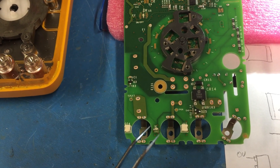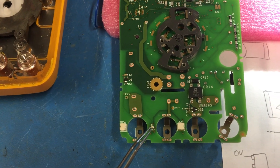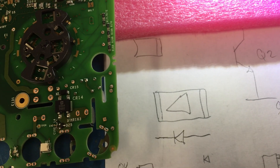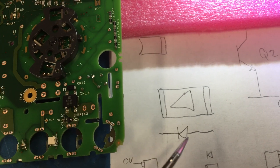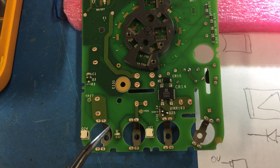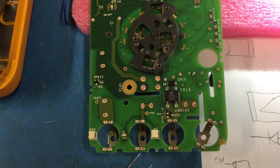There's some drive circuitry for the LED on the opposite side, just a drive transistor. If you have to replace the LED, note that the King Bright part has a triangle on the bottom of the part, and this corresponds to the diode symbol which matches the symbol in the silk screen — so that all fits correctly.